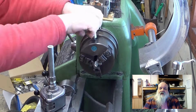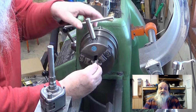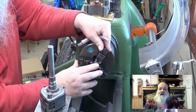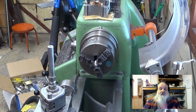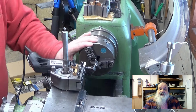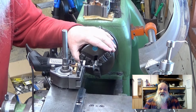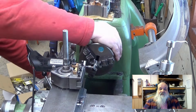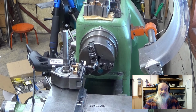Some time ago I made a holder for my Dremel for small grinding tasks in the lathe. In this case, the hard outer layer of the bearing ball will be ground off so that a normal high-speed steel drill can be used to drill the needed hole. I keep the grinding dust off the base with a rubber mat. I run the Dremel at 10,000 revolutions per minute.